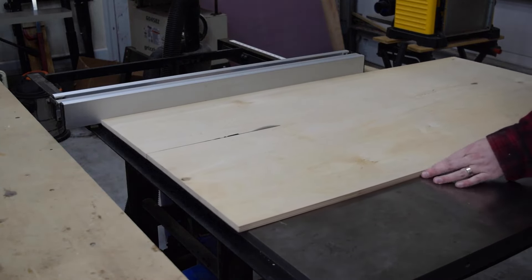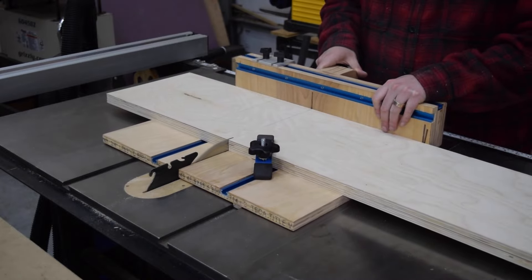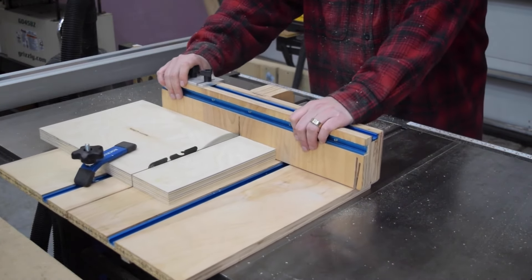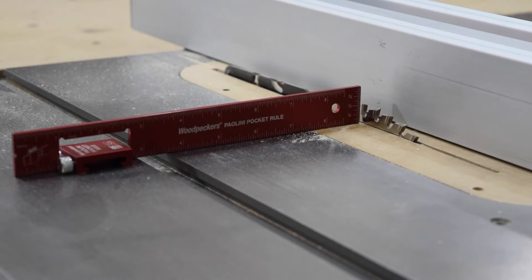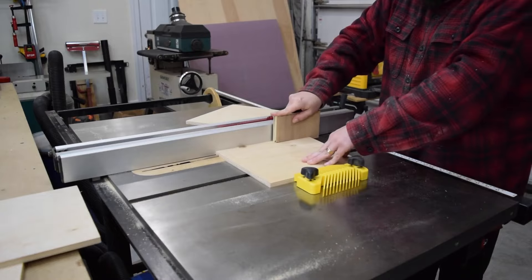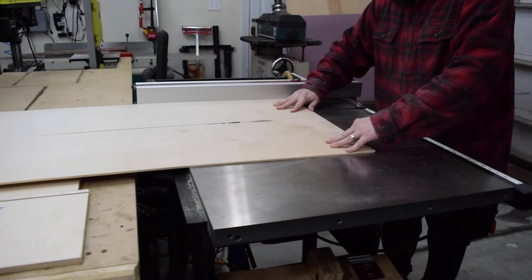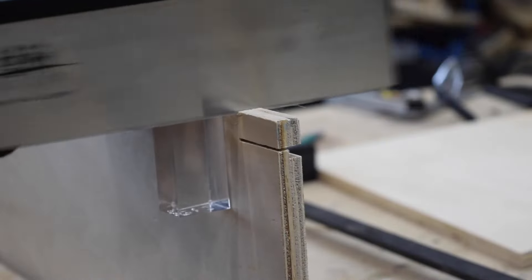I could then start building the drawer box. For this, I'm using half-inch Baltic Birch plywood. The front miters were cut using a miter gauge and a stop block to hold the pieces in place and stop any deflection. I cut in the grooves for the drawer bottom using the table saw. Finally, I cut the drawer bottom from quarter-inch birch to its final size. For this piece, I used Blum drawer slides, so at the bandsaw I cut a small notch for clearance of the slides on the back of the drawer. I then finished notching out the back with a pull saw.